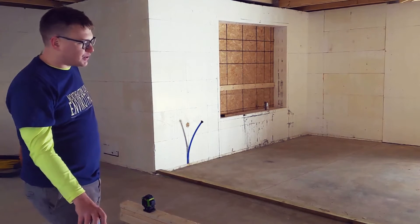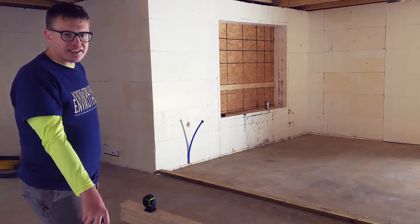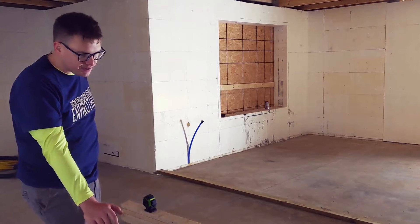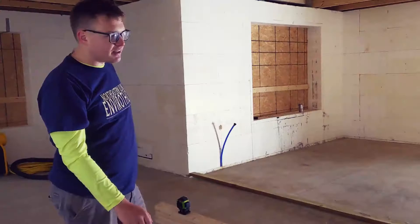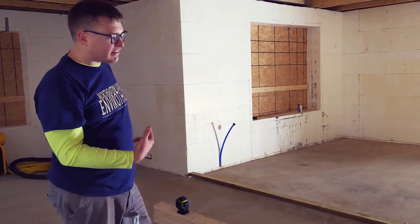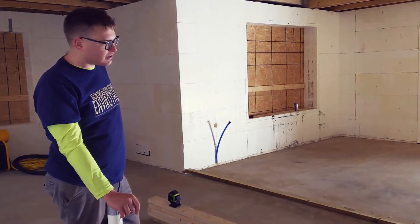If you are using a pressure-treated bottom plate, you need to be using galvanized framing nails — they'll be right next to each other in the nail aisle. I'm using 12-penny because I have a framing nailer. You'll see galvanized and non-galvanized. The un-galvanized ones are like $60 for 2,500 and the galvanized ones are about $100, so they're a bit more expensive. I'll probably be changing out nails and firing galvanized up to the bottom plate, then switching to brights — non-galvanized — for everything else just because they're so much cheaper.